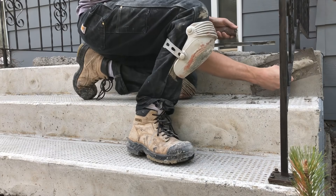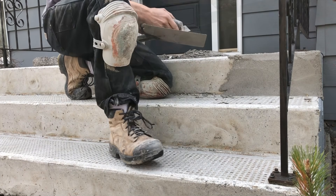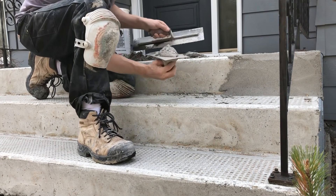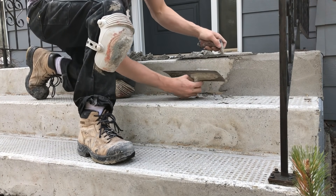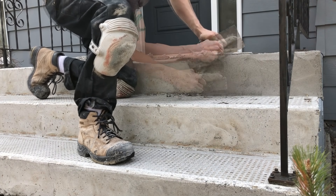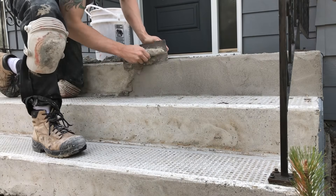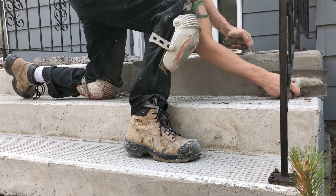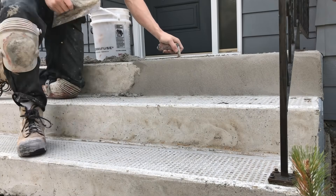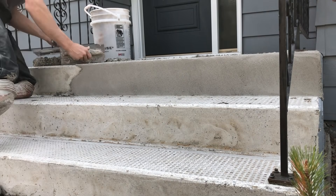At the start I had the base of the railing in my way, so I just had to work around that part. A good technique is to spread out the material along the top of the step and scrape it right onto your trowel — not too much — and press it into the middle of the step, not at the bottom where you get too much buildup. Trowel it up into that upper trowel so it sticks right on the stair, and any excess just push into the base. Once I'm about a third to halfway down I go back and do the finish pass, spending more time working the trowel with differing pressure to smooth out the riser face.